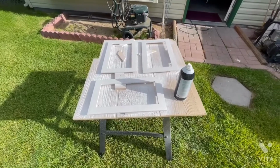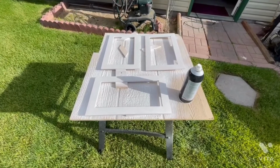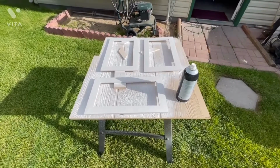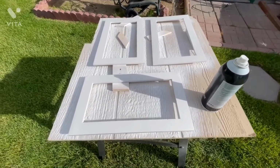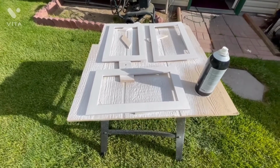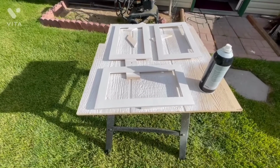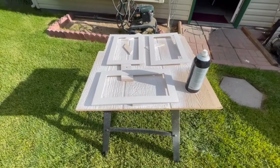Okay, we've got a first coat of paint on these other three frames for the grills, for the air returns, and the wind is blowing real good out here, but no dirt in the air, so we'll let the sun and the wind dry these a little bit and check on them. But just wanted to give you an idea of what the three other frames will look like, and we still have the holes to drill, put the T-nuts in, and get the filter material cut and trimmed, and then of course go out and mount the frame of each one of these up in place where the old grills were, and then put the new grills and filters in. But that gives you an idea of what the project's going to look like, I hope.